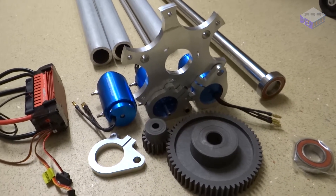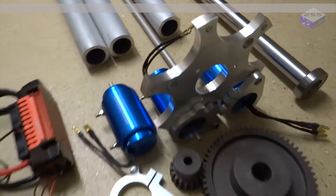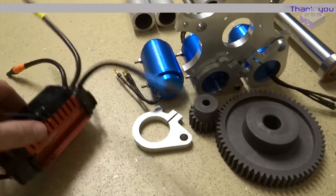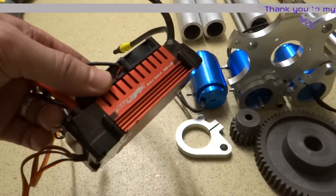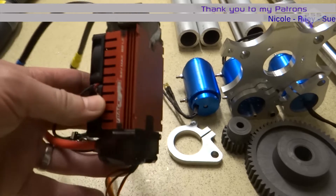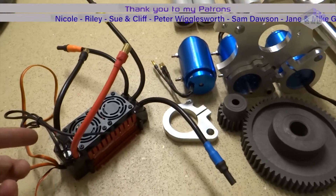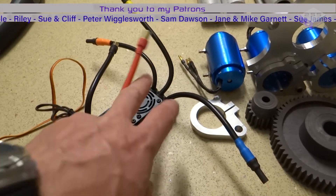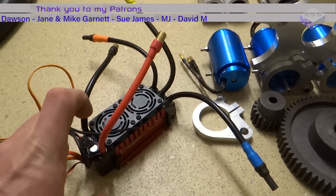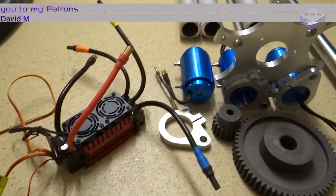Hopefully you can see it coming together here. You can see the motor mounts and the motors. So I've got three motors and three ESCs, but this is one of the old ones with two fans on top. Trackstart no longer make these — I can't seem to find them anywhere. But they've uprated these — they're still 200 amps at 34 volts, but they've uprated the connections. They haven't got fans on top so the heatsink's a lot bigger, and they're slightly smaller profile as well. So it should make for a smaller power unit, possibly even lighter.